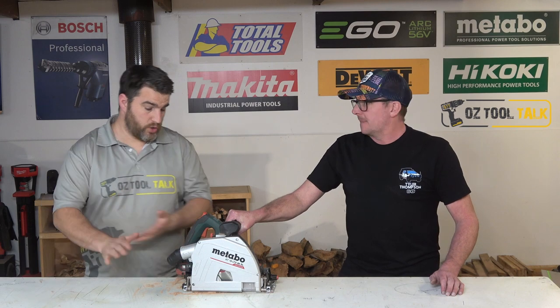Worth mentioning: the '66' in the model number represents the depth of cut, and that's a really deep depth of cut for a 165mm blade. A six-and-a-half-inch blade in a handheld circular saw would usually only get 55mm. Track saws do tend to have an offset motor for deeper cuts, but this is still a good 6mm deeper than others on that blade size. Even once you put it on the track, you'll still get well over 60mm depth of cut. Looking forward to having this as part of our upcoming track saw comparison coming up this year.